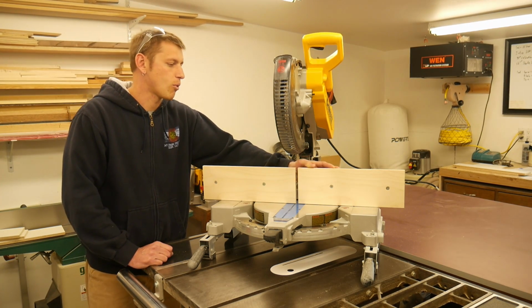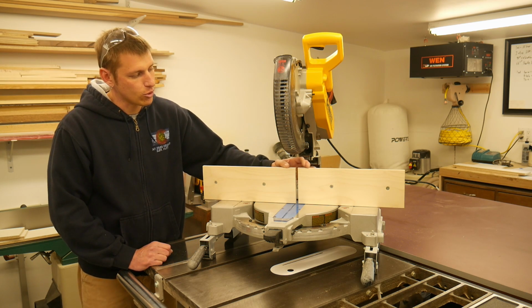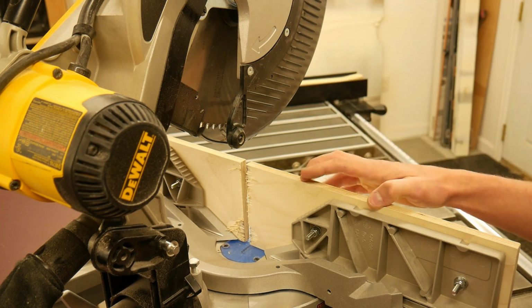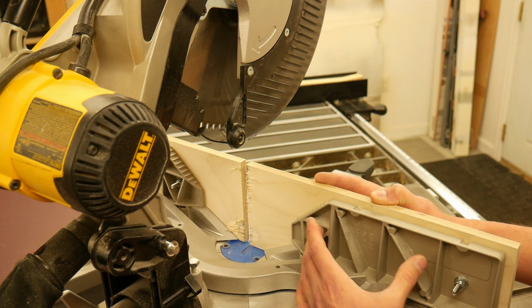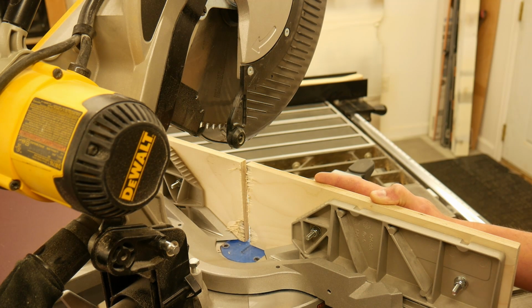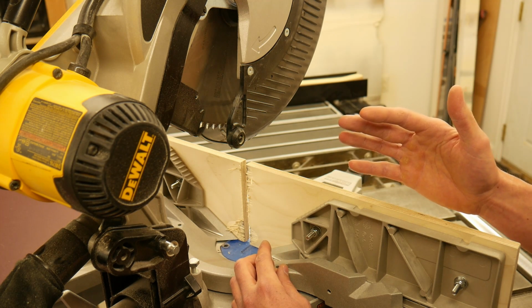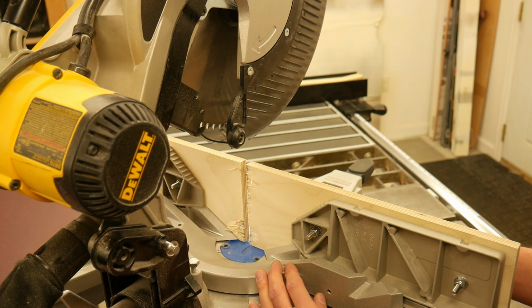The length of the boards we usually do is about 15 inches a piece. I found that's a pretty good board. We can set them back a little bit so we have plenty of room for error. So the reason why I make the boards 15 inches a piece is I set the factory fence, I slide it back a little bit and actually have a gap. Usually I slide it back about 2.5 inches. So then if the saw does come uncalibrated for some reason, rolls around in the truck, it's all happened to us, you can actually slide it back forward and redo your cut.